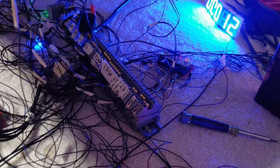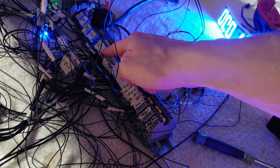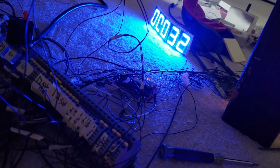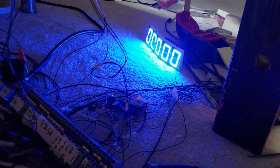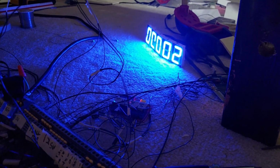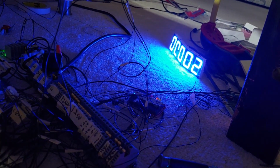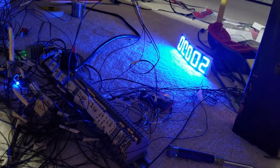Okay, by the way, I did figure out what was going on, why the 10 points weren't triggering. I had a jumper loose on this 0-volt terminal here. So now, if I trigger this right here, I get 10 points each time. If I do a reset, then normally I'm getting 1 point each time I trigger it. And also, the next 7-segment display came in. So that one that's obviously messed up, I just have to get this thing resoldered, and we'll be good to go on that.